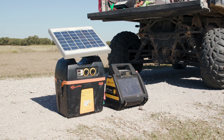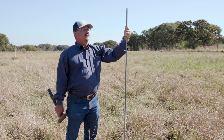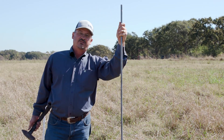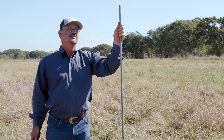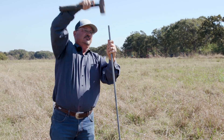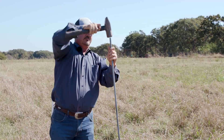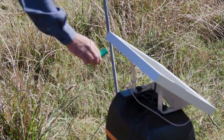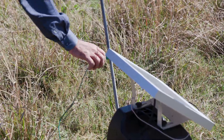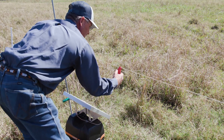What we're going to do is hook this solar charger up to our fence. The first thing we do is drive a ground rod. On temporary fences we don't drive it all that deep like you would for a permanent fence. We have our alligator clips — this is our ground wire — and we're going to connect it to the ground rod, then clip our red wire to the fence.